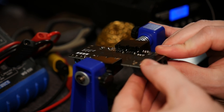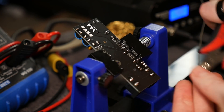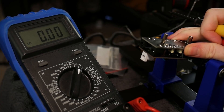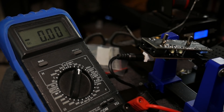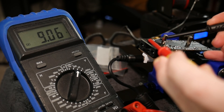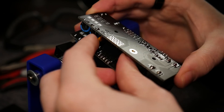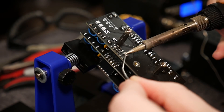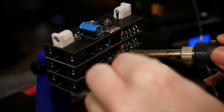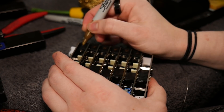We'll be talking very in depth about different power supply technologies when we come to look at the K Plus systems very soon. On the boards there are two outputs, protected again by more diodes. You need to clip the legs of these output jacks short or the whole construction will not fit together correctly when assembled. Reading the voltage at the output pins should confirm the nominal voltage for the board we've constructed. Now that I know I have everything correct I can make all of the remaining boards in the exact same way. Leaving the pins unsoldered until the final assembly stage is wise as we need to alternate the order of these so it lines up correctly with the preceding board. With everything together, a final voltage test of each board confirms that all the voltages are as we intended.